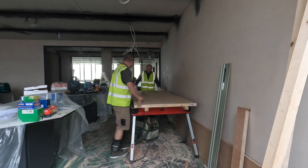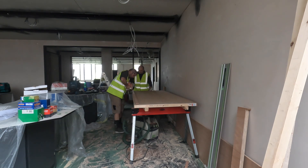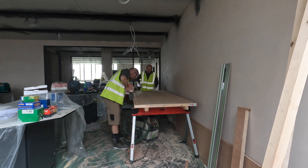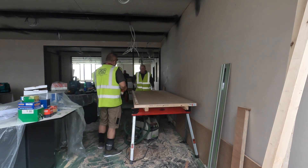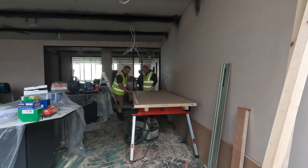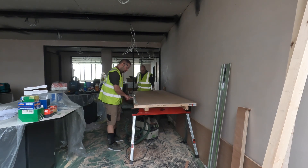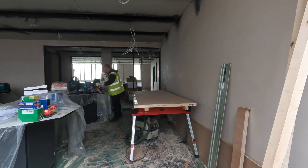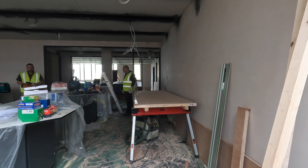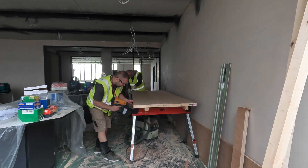I always try to go for three to four millimeters, depending on the door, what kind of brushes you're using, and what kind of locks and door closers you're using. In this case we didn't know at the time what type of lock or door closer we'd use — probably a very good door closer because it will be a heavy, large door. Basically, the smaller the gap you have, the more difficult it will be for the closer to close the door because of the brush. Always think ahead in terms of locks and door closers, and try to go for the biggest gap possible — in this case four millimeters.